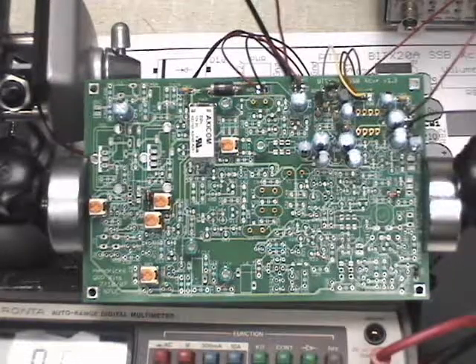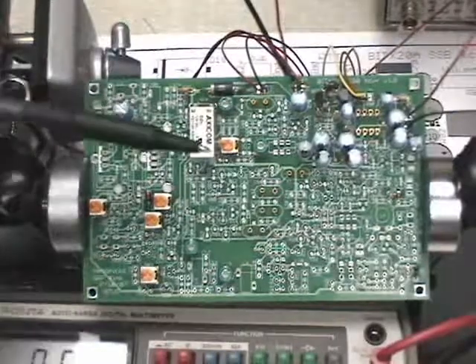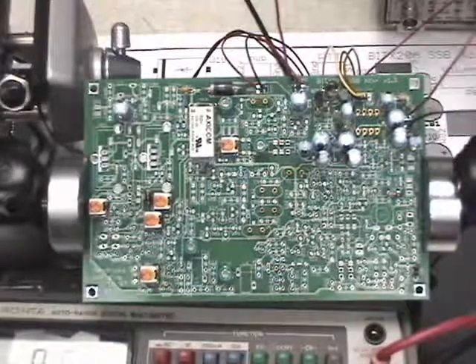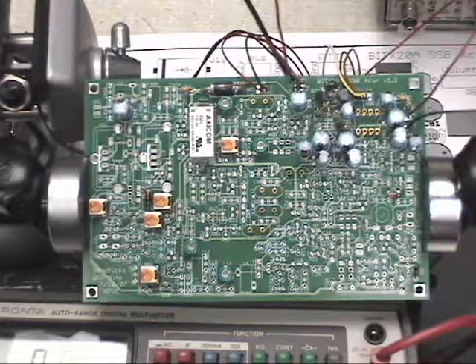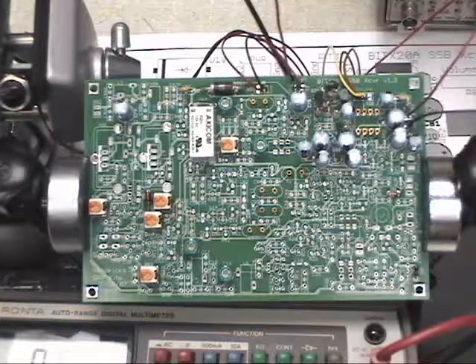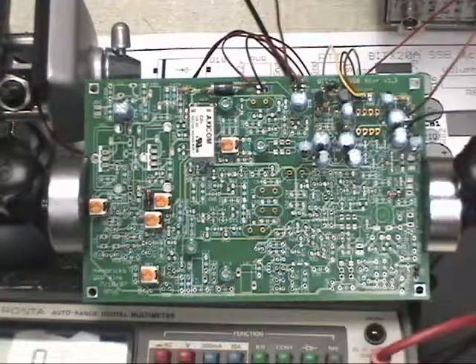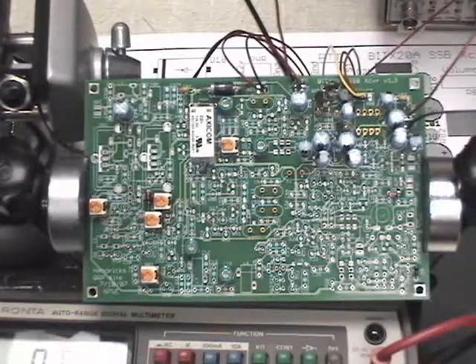I'm down to the miscellaneous section test on page 7. I've made a couple of minor changes — instead of soldering the crystals in at this time, I've put sockets in there because I want to be able to do some sweep frequency testing on the filter later on. I'll be adding sockets in various sections of the board mainly for feed-through capacitors so I can isolate one section from the other. That's the advantage of building it one section at a time, though doing it this way you end up with a lot of components in various sections, making it a little harder to isolate them. I'll handle that with sockets so I can plug components in.